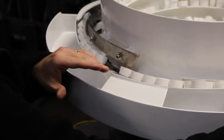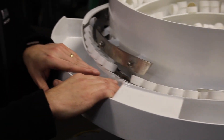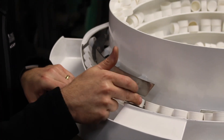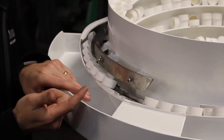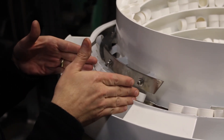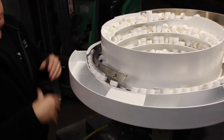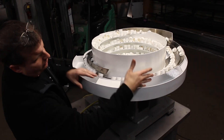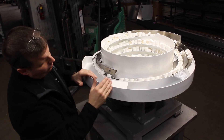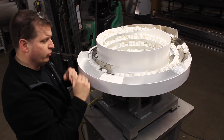We merge back from all of our multiple lines into one line, and then we come into this area, which is called a scallop selector. What this does is: if it's an upside-down part, it's going to select it off. Under vibration it will fall off; the flat side will feed down and pass. This is your final selector area into your discharge. Anything that doesn't get selected positive falls into your return pan, circulates back through your bowl, and back up for re-orienting, to increase your rate and get your output.